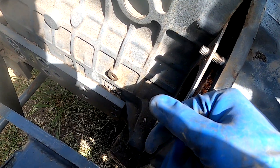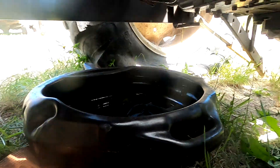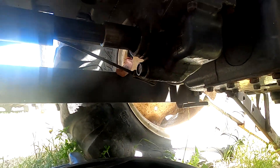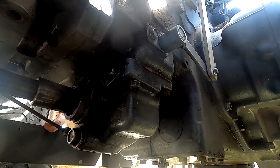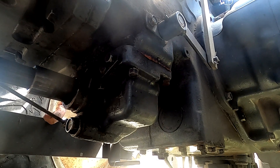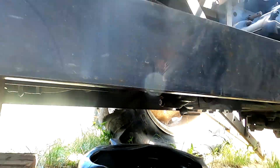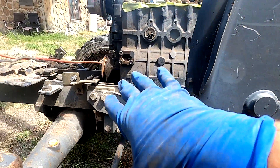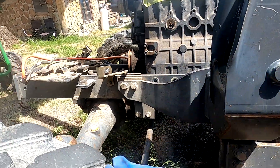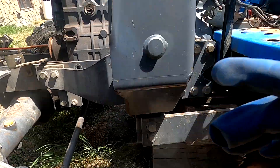Not a big deal at all. We'll try to do the easiest possible way. We're going to drop the propeller shaft — drive shaft — and remove those bolts around the transfer case housing. Drop that down, pull the shaft out. Then we'll remove our front loader towers and brackets, and that way we can just roll the front axle away. We still have the engine supported.